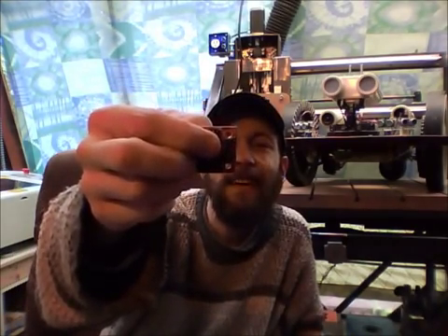Then you've got a motor driver on board — that little teeny guy right there. It is quite possibly one of the sweetest motor drivers I've ever dealt with. Per the specs, you have 800 milliamps and you can run 800 milliamps all day long. Even better, it has a stall warning at just over 900 milliamps — 910, I think to be exact. Basically, when your robot runs into the wall and the wheels stop turning, or when carpet fuzz gets wrapped around the axle and the motor starts working really hard, it's going to start sucking more power.